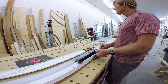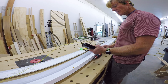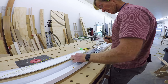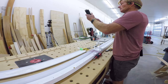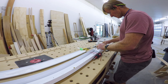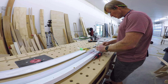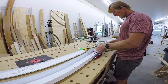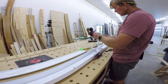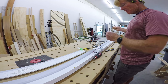I'm going to leave a little bit of wire on these ballasts so they can be reused in the future on a light that may fail — a perfectly good ballast can be reused to rebuild another light. It just comes down to black and white, and there's no polarity here, so it's one side or the other. I'm going to take the blues and the reds, put them all together and make this the black side, and then the yellows on either end are going to be the white side.